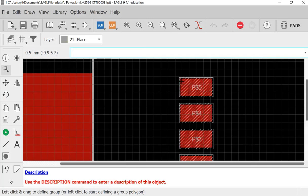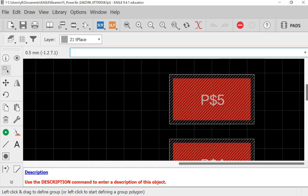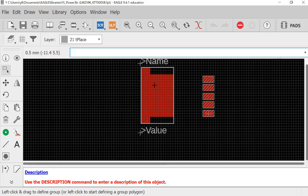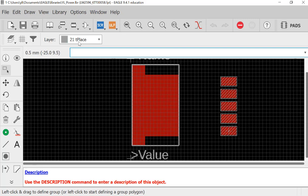So you can see all these pads have a T-stop layer covered on the top. Which means that the paint, whatever, can be blue, can be black, can be green, on the PCB is not going to cover this area. Because they are pads, right? You are going to solder your chips to the pads over here, so definitely you don't want any paint on the top. But here you don't have anything. So that's why you need a T-stop layer.